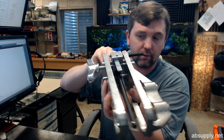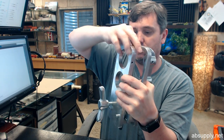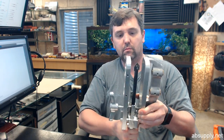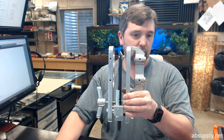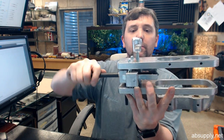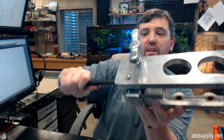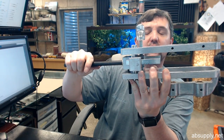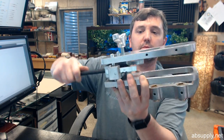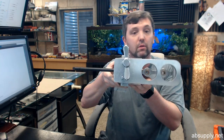So you're going to draw that back. Okay, and that bushing will get down there. Get that spade bit down into the tool. It's first time in, requires just a little bit of working, but after just a little bit of hand shimming, it'll get all the way buried down into where it can reside right down in the edge of the housing without making any contact with the edge of the door. That spade bit is going to sit right in there like that, as you can see. So that's one of your 2 cutting tools loaded.